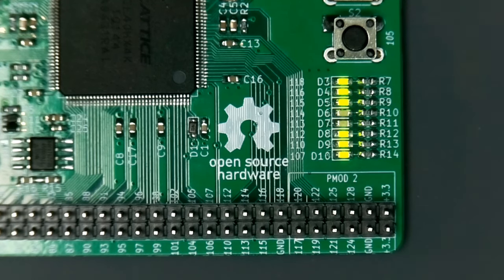And I've got to tell you, when this thing first started working, I was very happy. This is great, because it means that our signal integrity is pretty reasonable on the Project 2067 board, because if it wasn't, there'd probably be all kinds of glitches, and it wouldn't be that stable, right? There would probably be enough errors where we might see the lights flicker from time to time. And it's running slow enough that we can see each individual LDIR instruction.